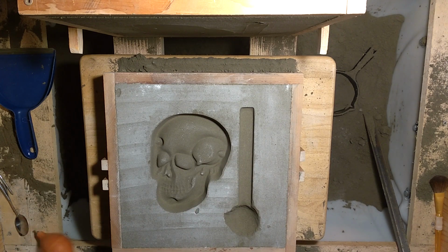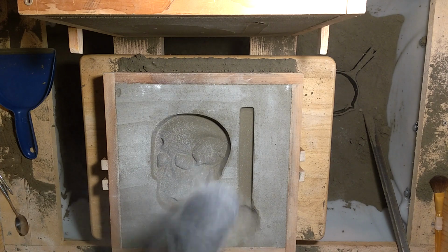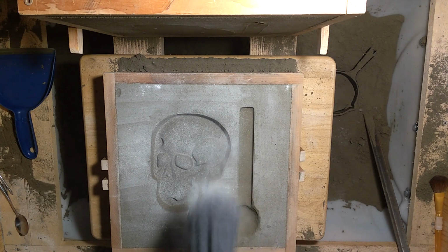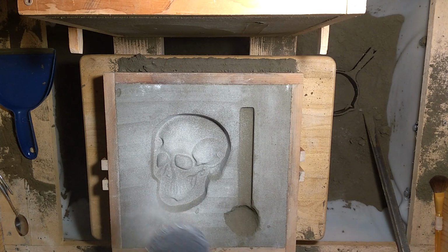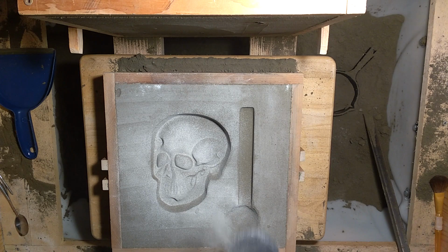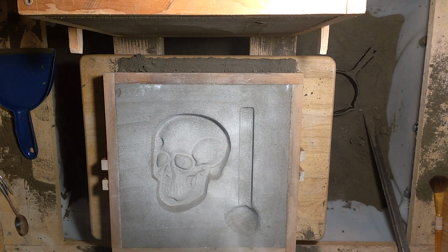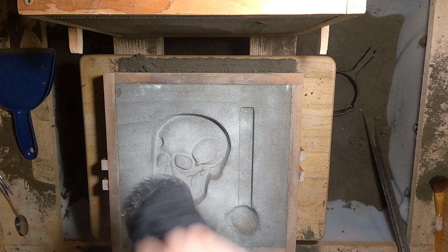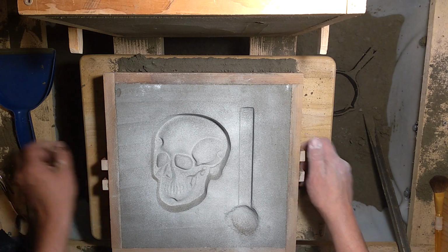All right, a little bit of parting just to keep any loose grains from sticking to the inside of the mold. Put more than I need here because I'm gonna blow it back out later. But this should make a nice protection against anything that falls in there that might want to stick and not be easy to get out. All right. So now,